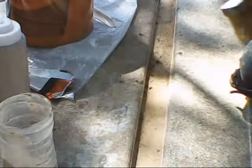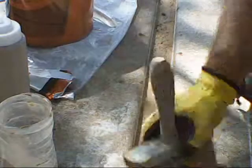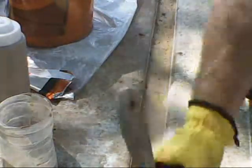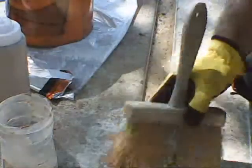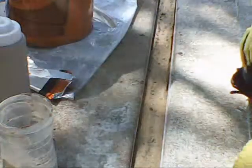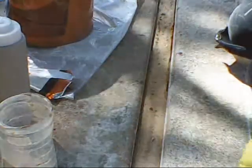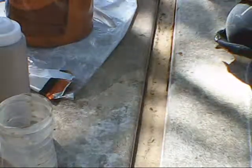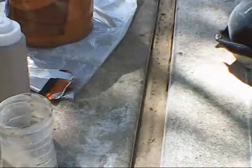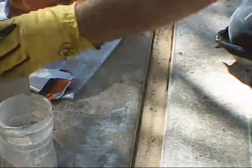Keep a cup of sand handy and work down the joint. We've already made sure the joint is nice and clean, and we've already ground the inside so we know we're tapping into a good substrate. I usually run a knife just down the edge of the area I'm going to do. Make sure there's no sand where you want to be tying into the substrate. Now we'll go with our mastic.